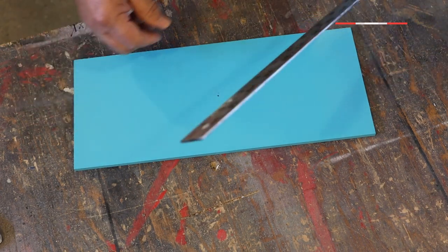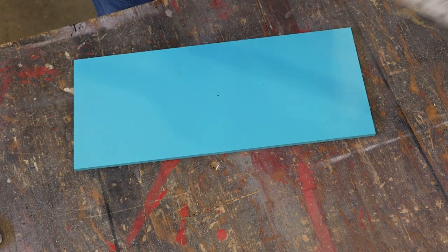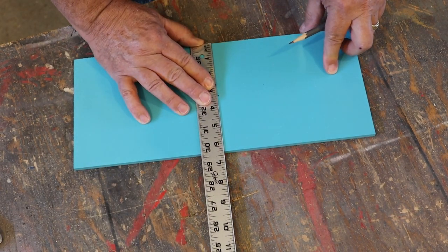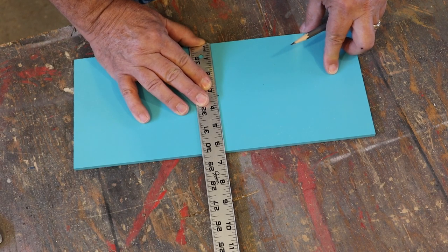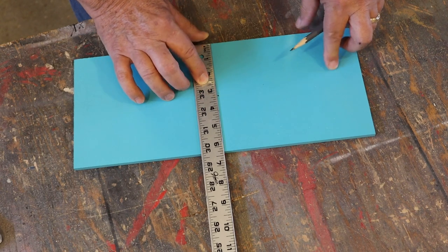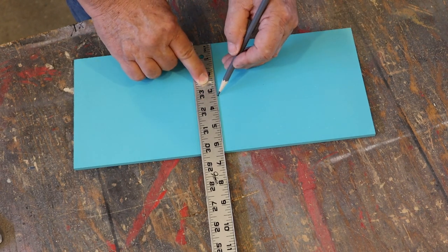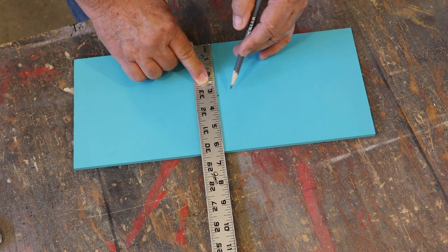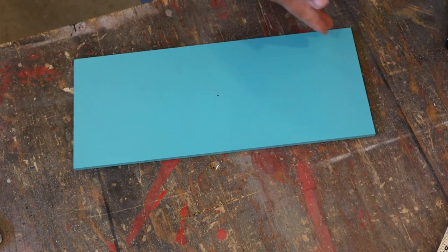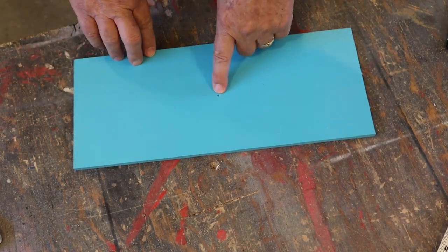And let's look at top to bottom. The overall width of the drawer front, or this rectangle, is about six and a quarter, which would make it about three and an eighth — and there it is right there. So in one measurement you've got the center point.